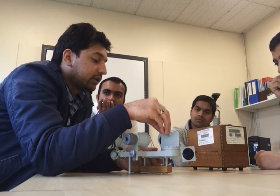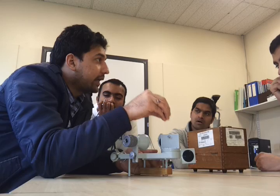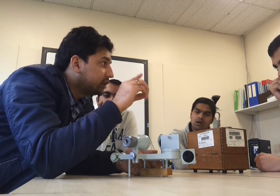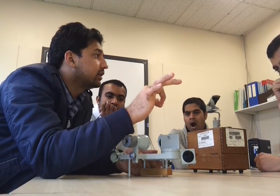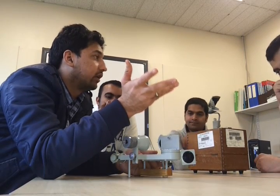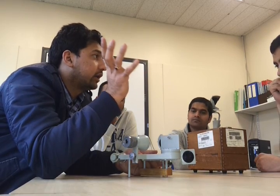This pivot point should lie exactly at the center of that geometric circle. If it is at the center, there will be no centering error. And these errors you cannot adjust on board. You have to send the sextant ashore to get it corrected.